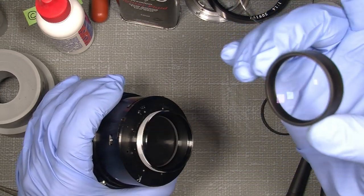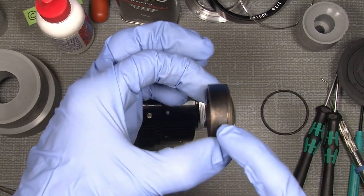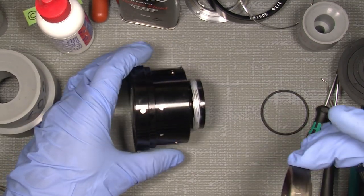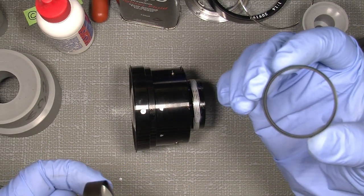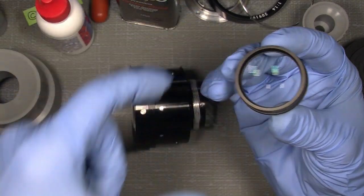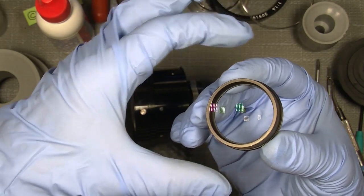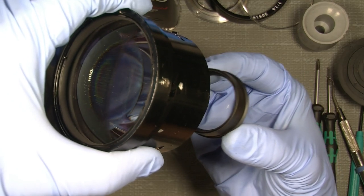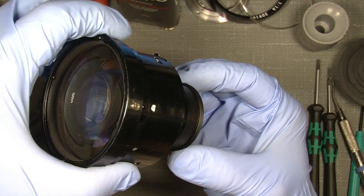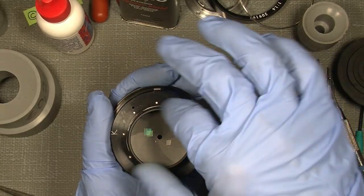the next lens element here, which I already have cleaned. Find the mark I set somewhere, it will say there. And it should sit in line with the adjustment screw here. And for that, I will just put the lens element into the retaining ring, so I do not hold directly on the lens, and simply put it in so it's in line with that. Correct there, just put it in, flip it over and simply screw in the retaining ring.